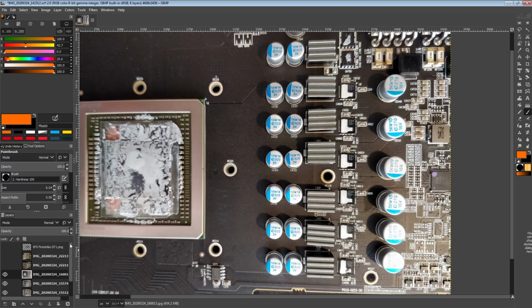The downside, of course, is that compared to the other capacitors, you're paying 4 times as much for potentially even less capacitance overall. So there's a balance that needs to be struck with the design, and that's also part of the reason why, if you look at the really ridiculous high-end extreme overclocking cards, you see capacitor banks where you've got your through holes for the total bulk capacitance to be really high, then your SMD polymers, and then multi-layer ceramics wherever there was free space.